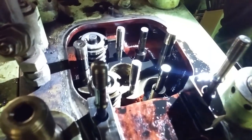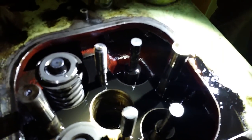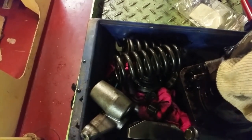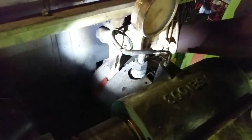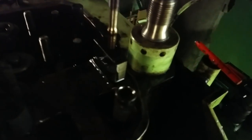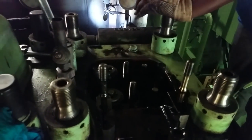This is the head that's going to come out right here. These are the two damaged valves - you can clearly see right there the parts that came out. So we're going to remove the shroud here on the exhaust - that's got to be removed. And then these four nuts have to be removed with hydraulic pressure, and it'll be ready to come out.